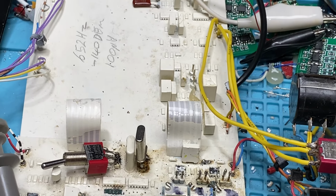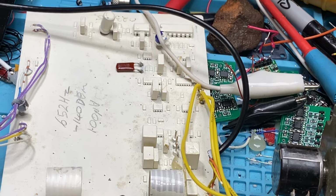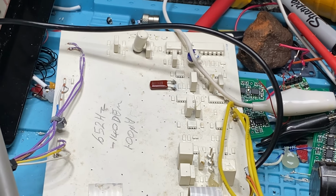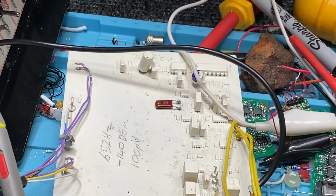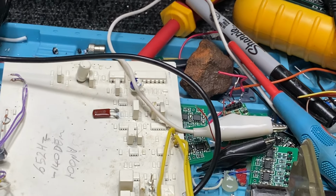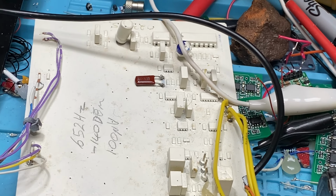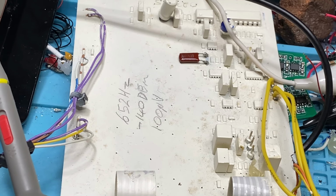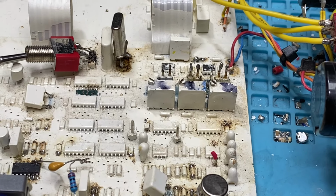Had to get under the capacitor, like on that 2100. By the way, the 2100 I did last night, it came up perfect. I had to remove the pots, had to remove the caps, had to remove all the glue, and it was, would you believe, a damn dry joint. And when I put it all back together, it was working properly. Then I had the trim pot tacked on, like these ones here, but the other ones on the 2100 are up in the air.